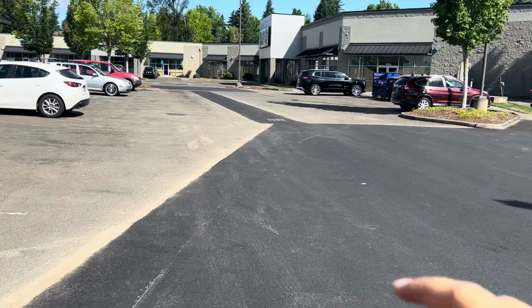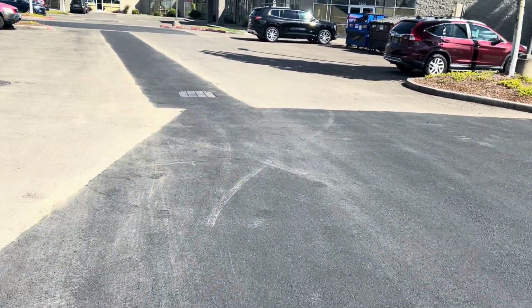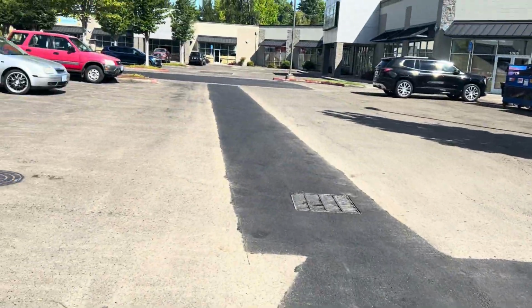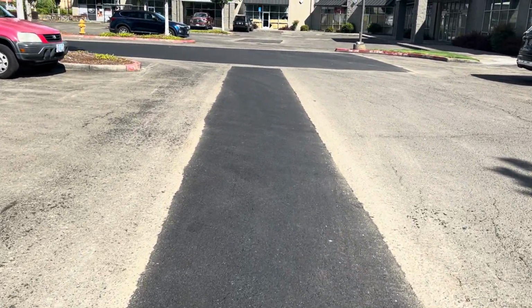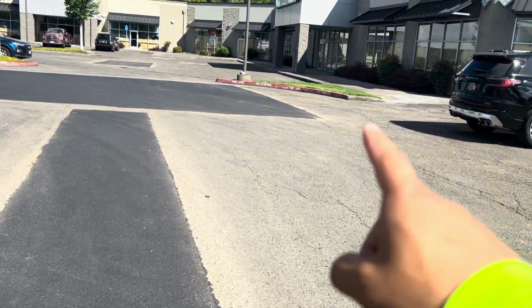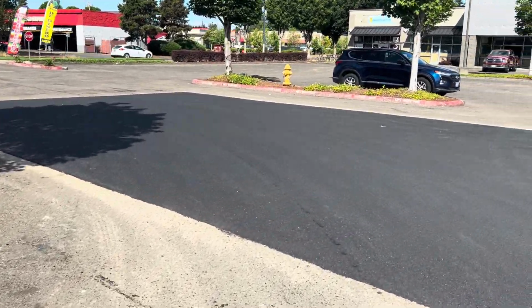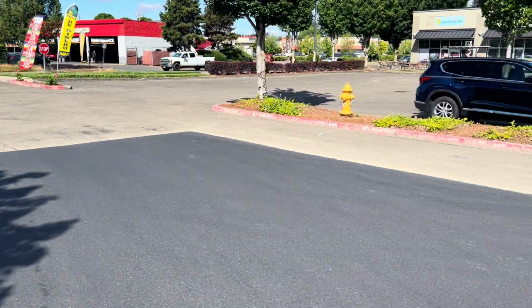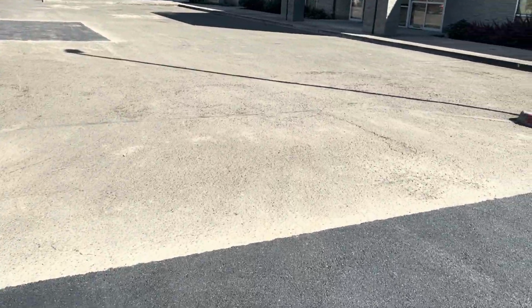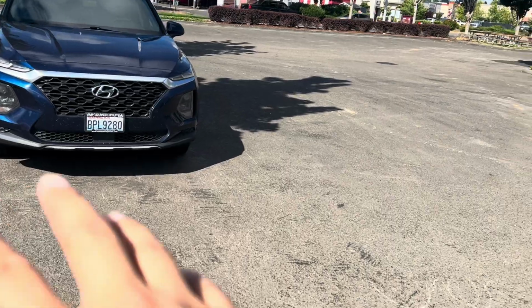Striping along this building, striping over here. There's nothing in front of this little alleyway deal. It's just going to be the crosshatching here. Got red curb, 4-inch MPFLs out through the drive lane. There's going to be a left turn arrow where that patches, right turn arrow, straight arrow. Stalls along this way, stalls along that building, stalls along the curb there, and then floating stalls right here.